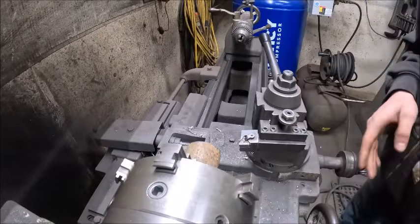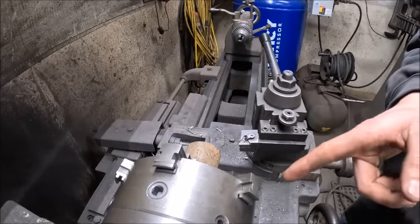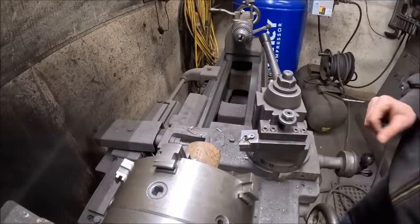Sleeves, we're gonna go through all 3 of them, get one side faced off and square, and then we can flip them all, or flip them around and do all 3 and get them sized correctly.